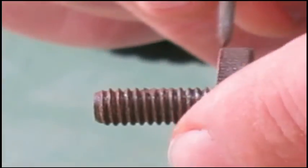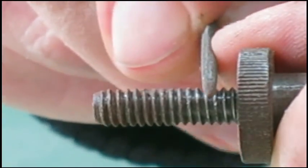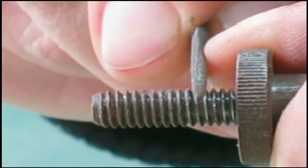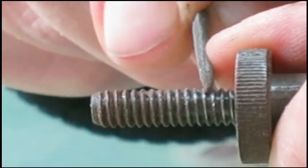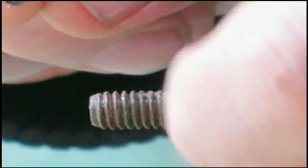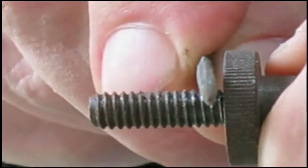And I got my magnifiers on. And this doesn't exactly come under a lot of stress, so I'm figuring I can straighten these threads out with the file, just by cleaning them up just a little bit and get the main guck out of there, and just sacrifice maybe a little bit of thread. The majority of it will hang on there. And the reason is that this adjuster has to come right out in order to flip over to handle the Veritas blades if I want to get another Veritas blade.